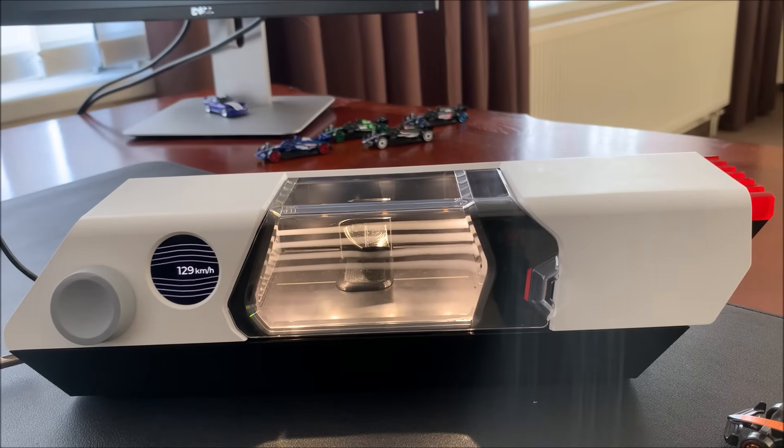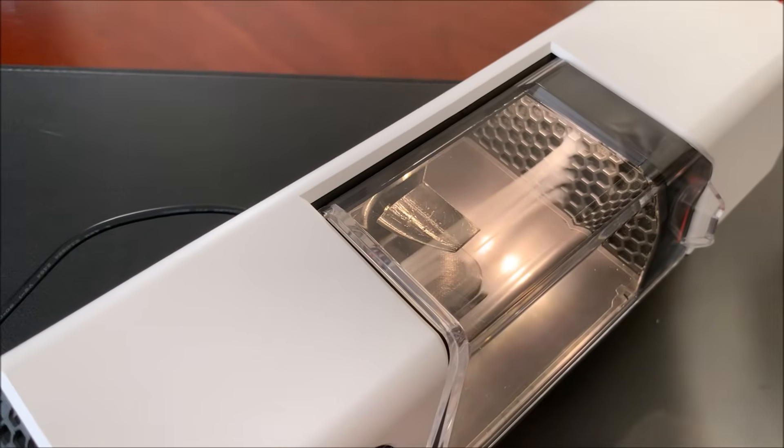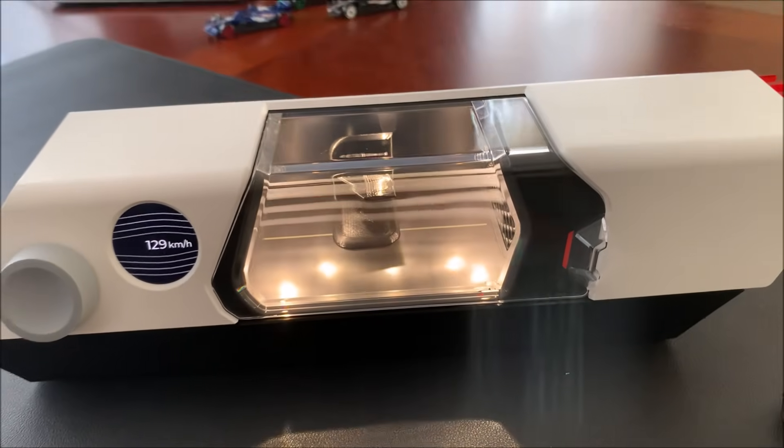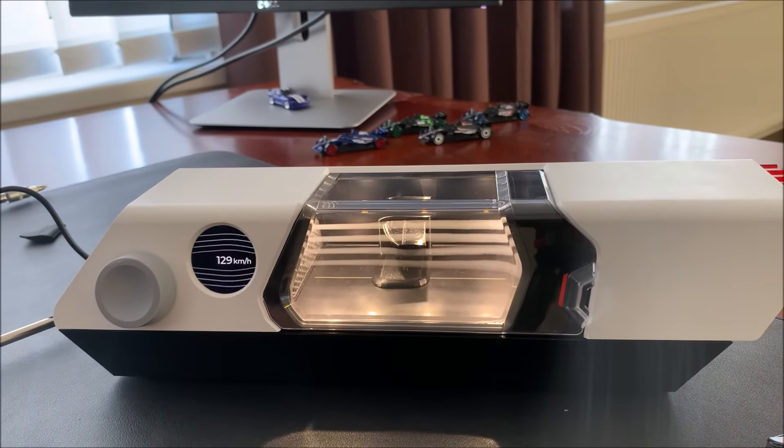The small symmetric profile is slicing through the air and doesn't really disturb it. It's a nice clean flow. This is how we can efficiently reduce the tip vortex and reduce induced drag — which is pretty much what airplanes do, and also what birds do, especially gliding birds at the sea like seagulls. Really nice to see how this principle works right here on your desk.